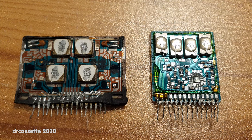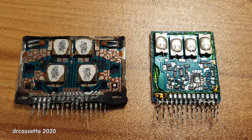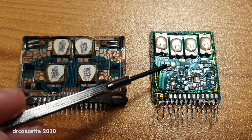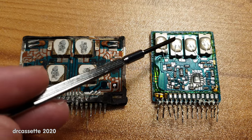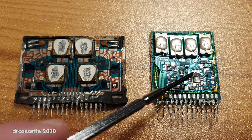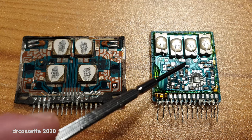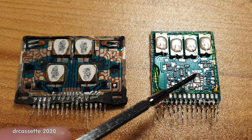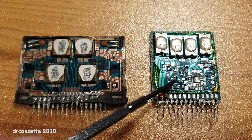The STK circuit is from the late 1970s, and this other circuit is from the late 1980s — about 10 years newer. The late 1980s circuit still has circuit board material and copper traces, but now has surface mount components: capacitors, resistors, and the big output transistors mounted to aluminum blocks. But now we also have integrated circuits — there are two integrated circuits in this hybrid circuit. This illustrates the difference: this whole thing is a hybrid circuit, but that tiny little square right there is an integrated circuit, and there is an even smaller integrated circuit as well.